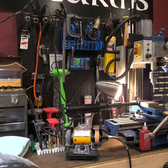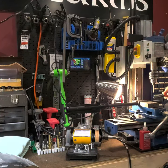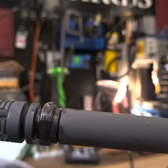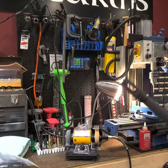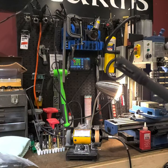Okay, I'm back. You can see here I've got just a little pin — holding it with pliers because it's a bit hot. It may have been 4 mil, I cut it down just a little bit so we get a slight protrusion. I drop this in there and give it a little tap. You can see there's a slight bit of protrusion — that's almost perfect. That's going to give you enough material to bounce your arc off with a TIG welder without needing any filler. If you're really low you'll have to add filler, and when you add filler in a small area where you just need to zap a dot, it can get messy and require cleanup. We're trying to avoid that — just do a one-hit and get this thing rocking.